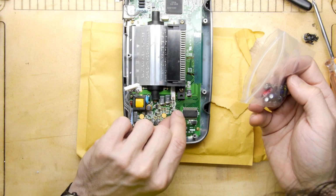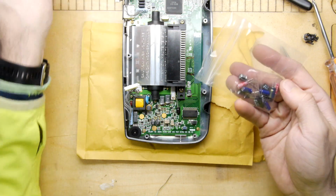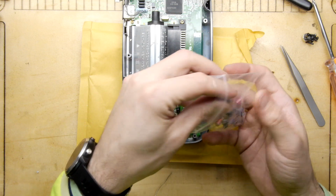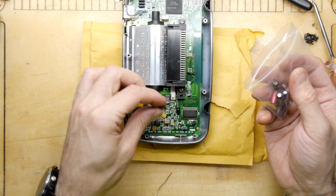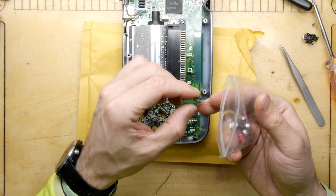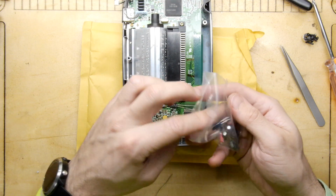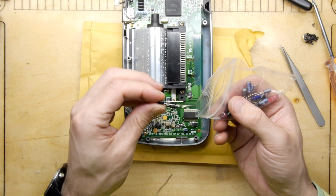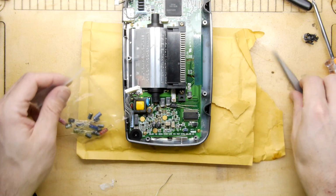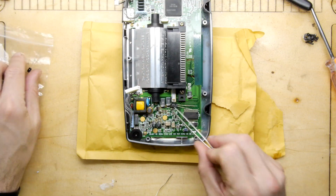And I'm just looking across the board. There might be hundreds elsewhere needed. I'm just seeing if there is a 100 in a different voltage range or something like that, because you never know. See, this is 100 as well. So that's a 25 volt 100, which I think will be used for the sound area. This is a 6.3, and this is a 4 volt 100 on here. So this one's probably okay. Let's put that big one back in the bag. See, that's why you check these things. And I'm rotating this one. This is a 6.3. Ha! No, that's a 6.3 volts, 22 microfarad. So this one will go here, for example. But let's just focus on this one now that we've got one.